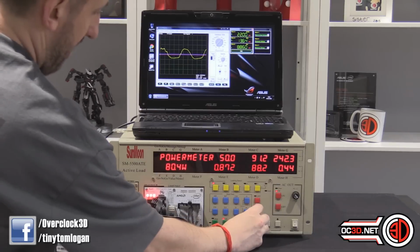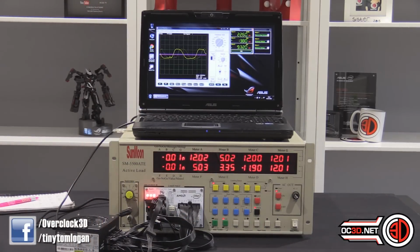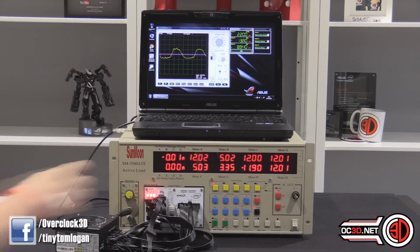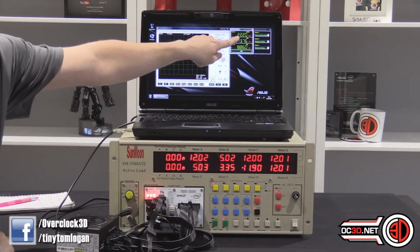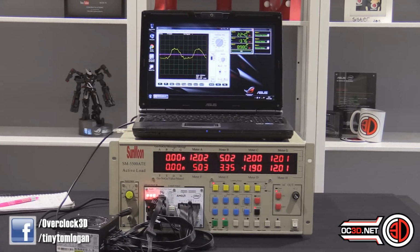If we look at our voltages here, they're very, very close to the 12 mark. I've written down 12.02, but with our graphs, it's very difficult to show the percentages down to that smaller fraction. And then the other thing that we need to look at is the ripple. I saw a maximum of 23 millivolts on the ripple. That's this number just up here. It's now 22.4, 22.2, but I've taken my result as 23. So 23 millivolts of ripple there.